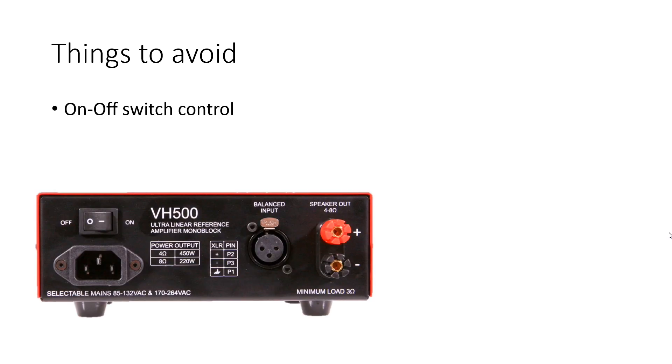Things to avoid: controlling the main switch during the on-off process. There is a spring-loaded mechanism built into the main switch that generates a kind of loud click noise, and people tend to slow this process to minimize noise — don't do that. There are inrush currents charging power supply capacitors at the moment of switching on. For slow switching, a welding process occurs, reducing the on-off switch lifetime. The spring mechanism works best for fast connection.